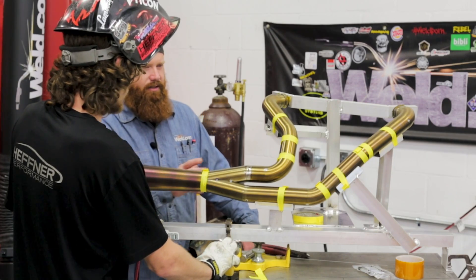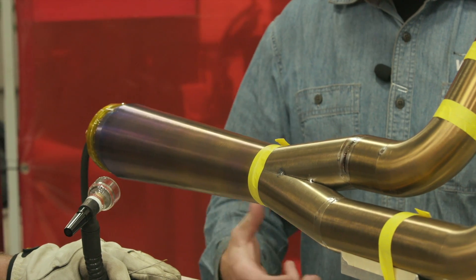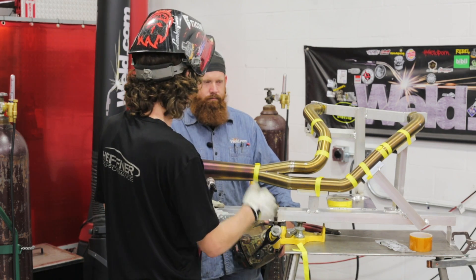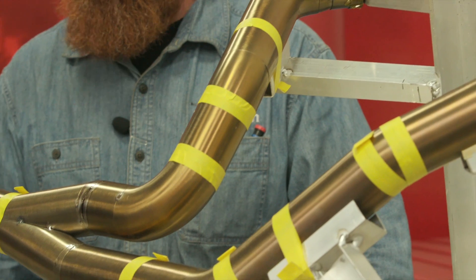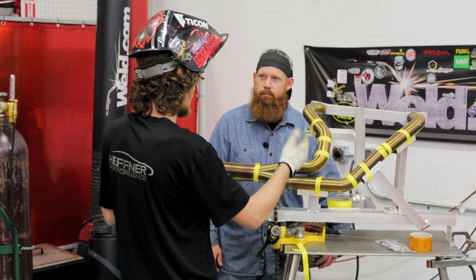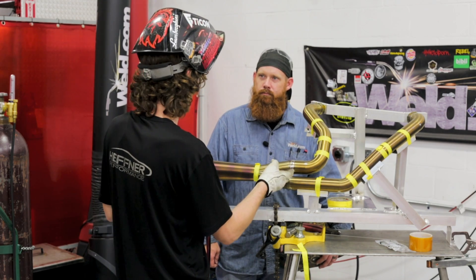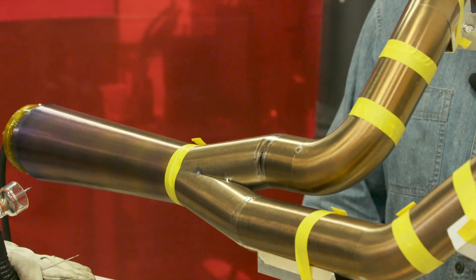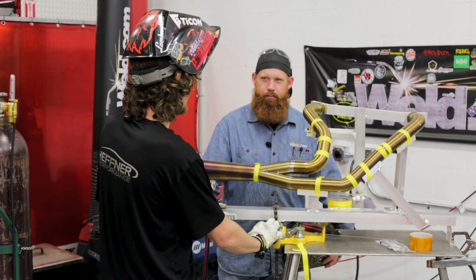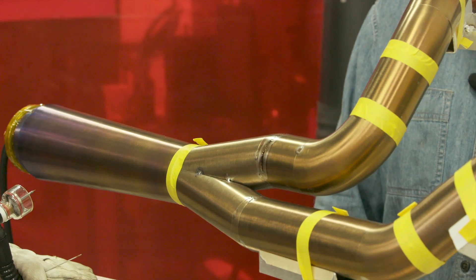So how do you go about the coloring? Once the welds come out silver, I notice you have straw turning to light purple, deep purple, and into dark blue up here. These are all consistent — I've done them through an anodizing process we use at Hefner. This section was done with a torch, chucked up in a lathe to evenly disperse the heat. There are other ways — you can brush it and torch it or anodize it however you want. But I really like showing the weld quality as opposed to companies that try to cover it up. All the welds will remain silver. It's like there's a lot of art involved — that's what this is, man. It's art.